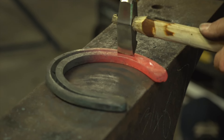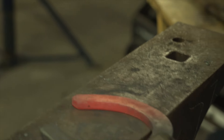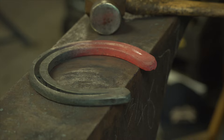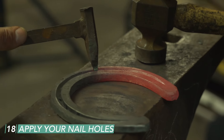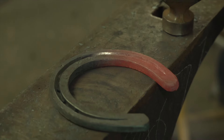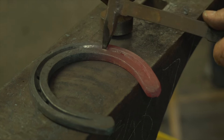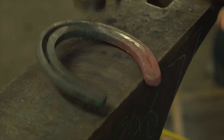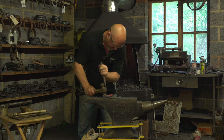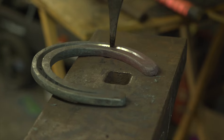The fullering can be blended all the way through from the center dot through the branch up to the heel, so everything is at the same depth. Once fullered, we can apply our nail holes using the stamp, in line with the lateral toe nail. A couple of sharp hits should be enough — you feel the face of the anvil. The medial heel nail sits slightly in front of the lateral heel, then straight in the middle of the two. With a nice cool heat, go over the pritchel hole and we should get nice crisp nail holes with no distortion.